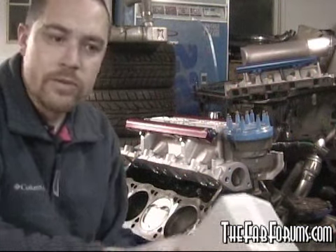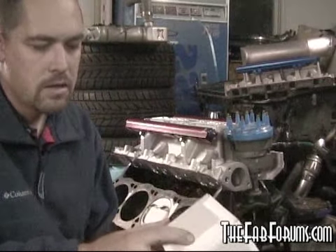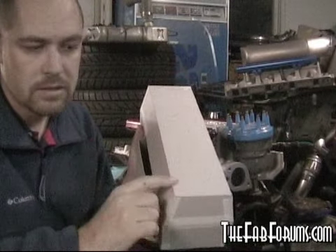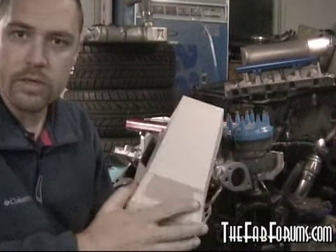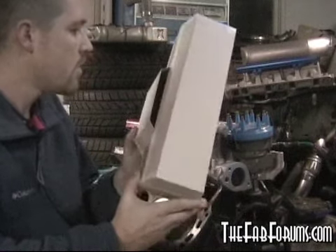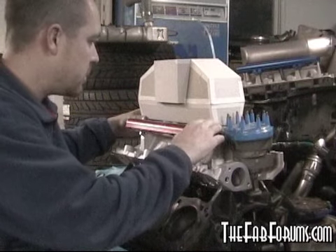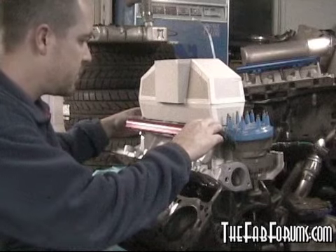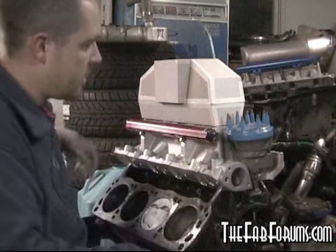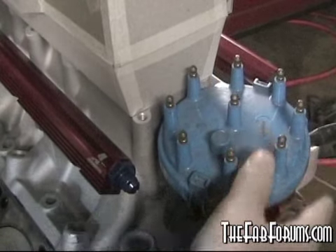There's one thing I wanted to show you before we get to the steel part. I made the lower — it was just a four-piece deal, very simple. Folded it up and taped it to the upper here. You always want to test fit these out before you get into the steel part — it's much easier to make any kind of corrections now, beforehand.